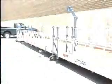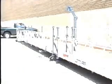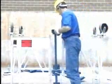Attach the extension section's top rails to the connecting frame ears. Install all wall roller assemblies and make sure everything is properly inserted and tightened. If necessary, use the same procedure to attach an extension section to the other end of your MKD assembly. If not, attach a standard or low mount stirrup.